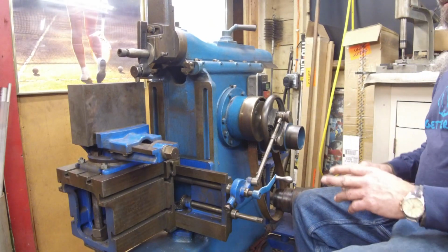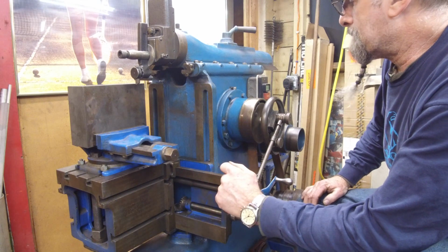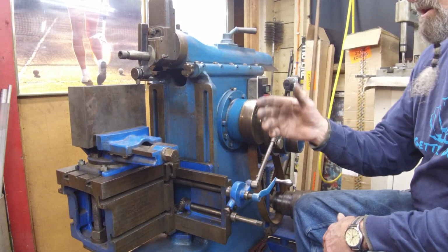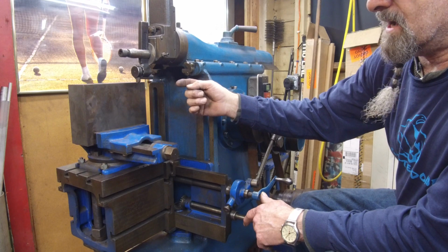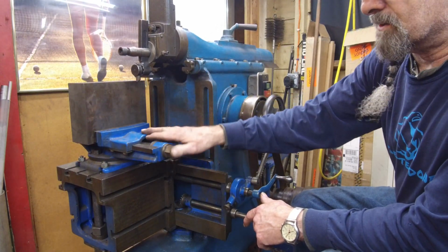Went and shut off the air compressor. I don't really need the air on right now, so I don't have that interruption. All right, back to setting up our stroke. We're going lengthwise on our part. For one, the grip on the jaw will allow you to hold stronger and have less flex and less rocking on a part that's taller than your vise.